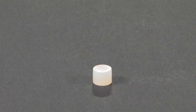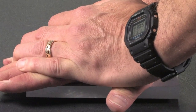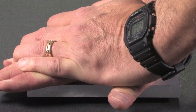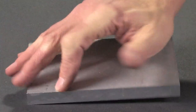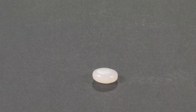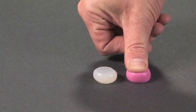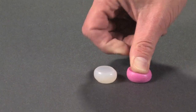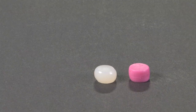The average stiffness of a particular viscoelastic silicone rubber also depends on its formulation. This piece is so stiff on average that it takes almost my entire weight to deform it, even when I'm patient. Once I leave it alone, it slowly returns to its original shape. But this pink viscoelastic silicone rubber is much softer, and I can deform it with only my thumb. Once I leave it alone, it returns, fairly quickly, to its original shape.